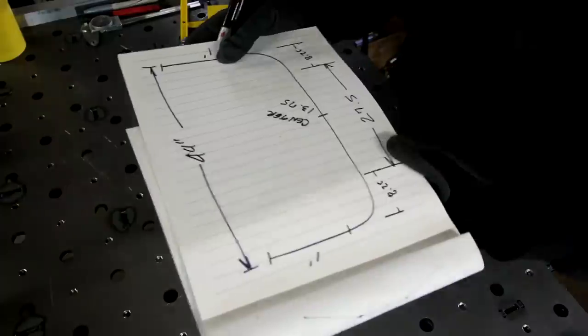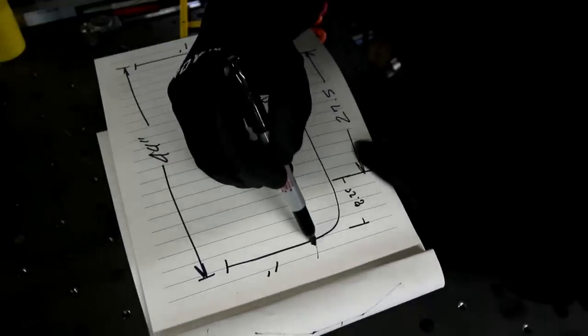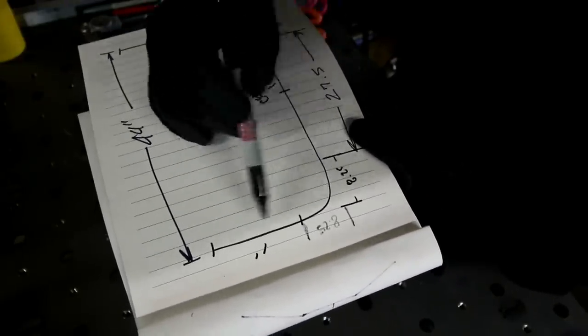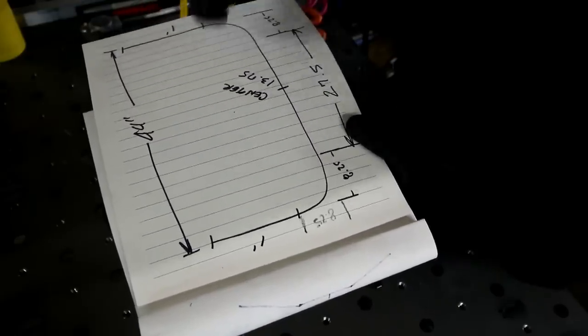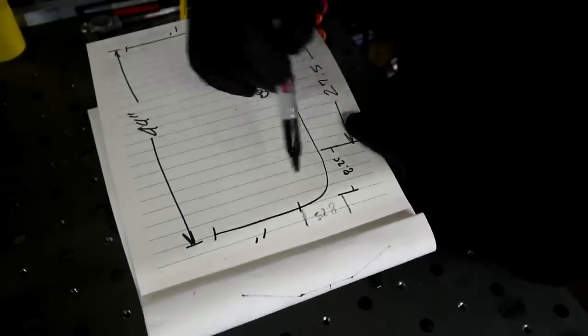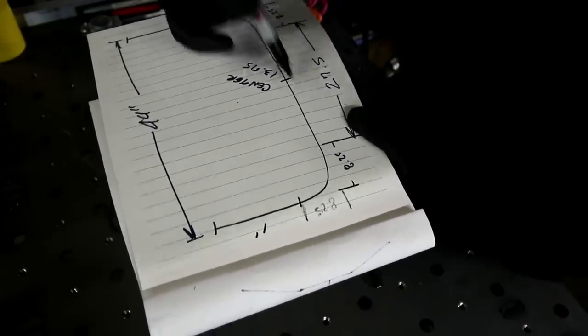is that I know it's 8 1/4 from basically the start of the bend to the back side of that bend, right? So this is 8 1/4. So 8 1/4 there and 8 1/4 here. So in order to achieve this 18 to 19 inches, I need to come back like a foot is what I've kind of figured up. And then another 8 1/4, which would actually be like 20 1/4 inches on this one. That's what I'm gonna go with, I think. So you got the foot plus 8 1/4. That's gonna get you back to this back side of this bar.